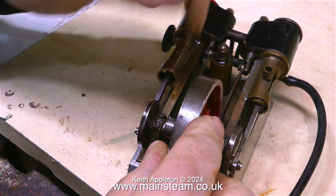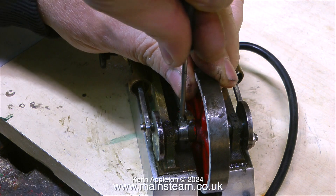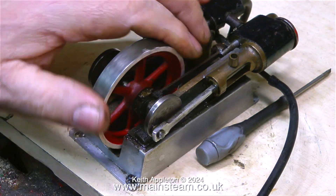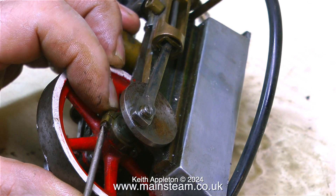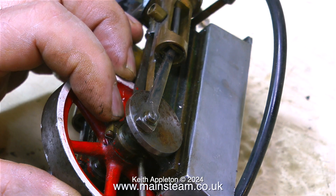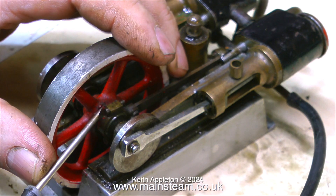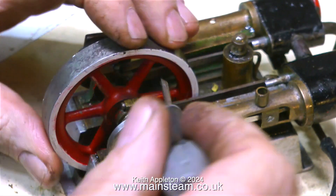The engine's timing is nowhere near where it should be, so I'm putting this right. Just for the record, the larger lobe of the eccentric should always be at the 90-degree position relative to the crank pin. On a twin-cylinder steam engine like this one, the eccentric on the other side should also be at 90 degrees to the crank pin, but in the opposite direction to the other crank pin. Oddly enough, on one side I couldn't find the eccentric adjustment — I removed the eccentric strap to realise there was no separate eccentric; the eccentric is part of the flywheel. How clever is that! So, feeling a little embarrassed for not knowing better, I refitted the eccentric strap, then slackened off the grub screw in the flywheel, which allowed me to rotate the flywheel and subsequently the eccentric to the correct position to make the engine work — hopefully.